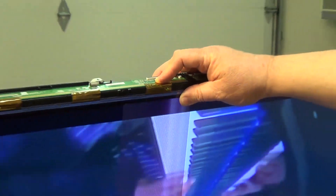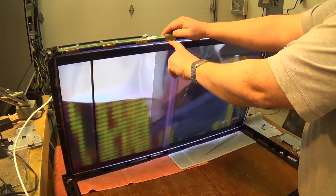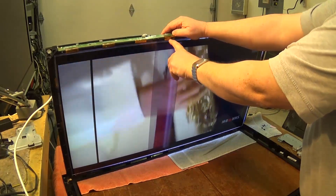The fact that my symptom changed — I went from all the little colored lines to almost having a picture — shows it's the strip that's the issue. I also got another line in the picture and a green line on the edge of the screen. We do definitely have a panel problem. It's not just the connections from the timing controller — it's actually on these tabs where our problem is.